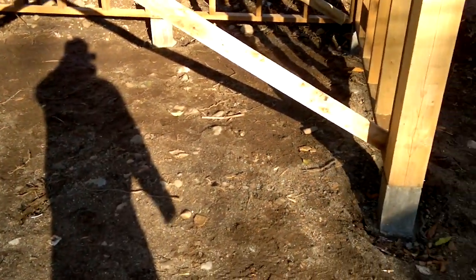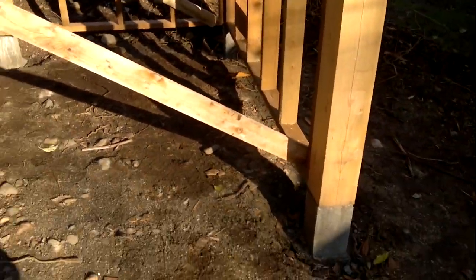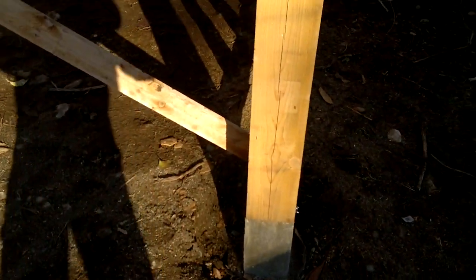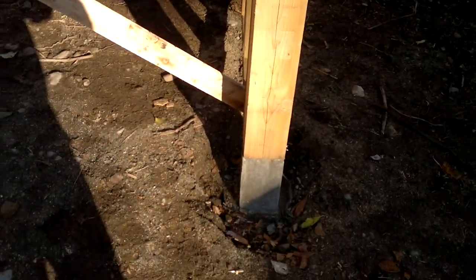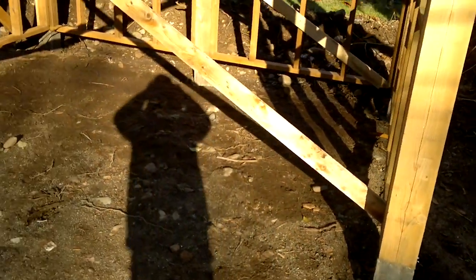And so then once our footings were set up, we put our posts in. Like I said, we have the rebar in there, so we marked out and drilled into the bottom of the post. We put the membrane, and then we put PL into the holes we drilled. We chose to use half inch rebar, and then we put our 5 posts on.